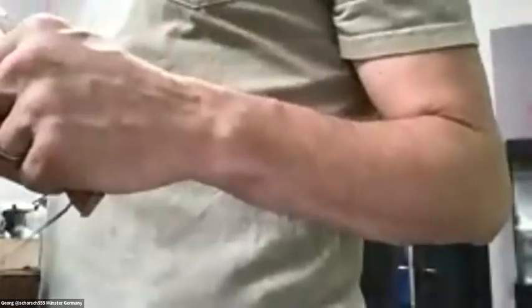So fundamentally the same technique as before, but the hole goes all the way through the handle. It is slightly more tricky to do because you have to align over a longer distance. So your accuracy gets tested more and more the longer the handle. Yes. Well, for that kind of thick screw tang, I would really recommend Phil's technique to just drill it with a lathe or with a drill press: first make a nice square block of wood, drill the whole way through, and then create the handle.